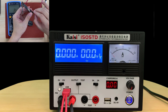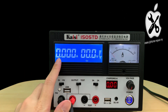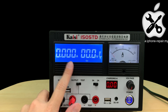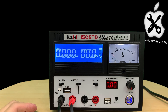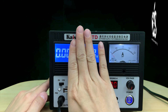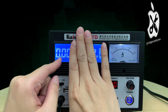By the way, why I suggest this kind of power supply — not just because of the functions I showed you. It's because I need the 3-digit value behind the decimal point. Let's say if I have a specific CPU problem or a coil problem. When I press the power button, if your power supply only has 3 digits total, no matter what value is in front, it just shows you 0.02.